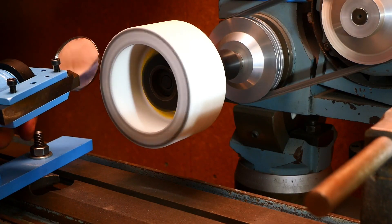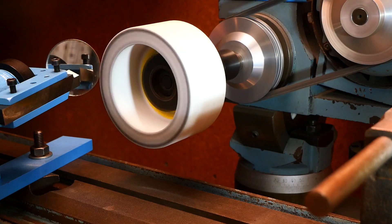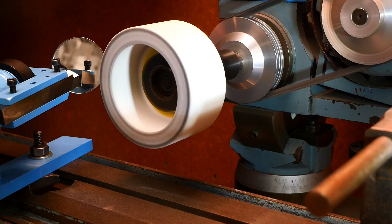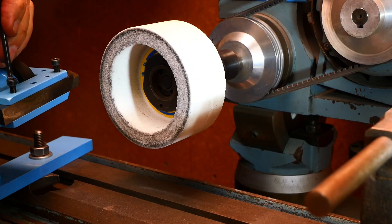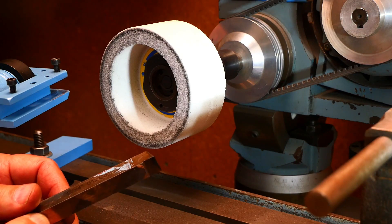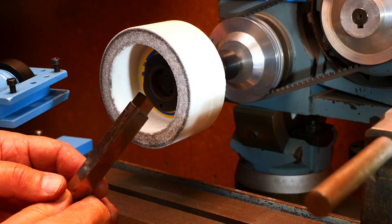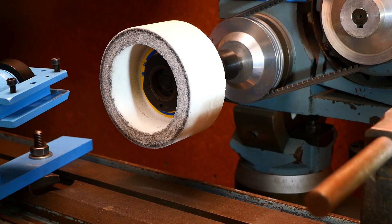A final check with a mirror shows that the front face of the tool has been ground all the way up to the top, and you can see it's clear right to that leading point. So let's finish grinding that front face. Time to take it out and clean it up with the diamond laps. Probably should have had some coolant on it — well, that's so many things to think about when you're doing something for the first time. It looks like I should have had some coolant on it, at least some air. Anyway, clean it up and then see how it cuts.